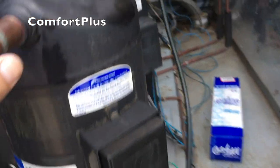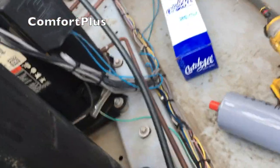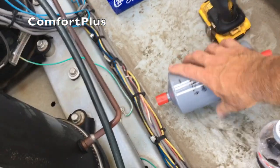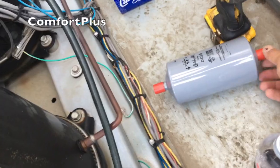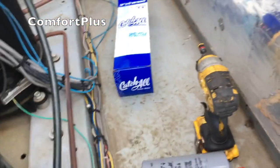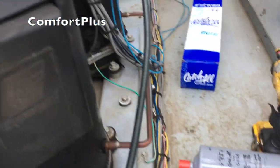I was talking to one of my buddies about it and he said, well, you know it was clean when they started. But these compressors — the windings break down. So I bought the biggest 5/8" dryer that wasn't one you take apart — 5/8" top size. I'm going to cut that one out, put this one in. Of course I'll have to pressure test and pull a vacuum, which will probably take a while on this thing.